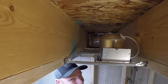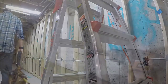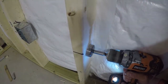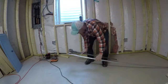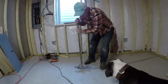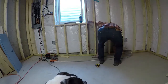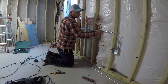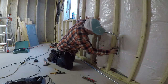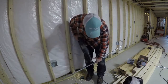Installing the can lighting is super easy — you can use the nail they provide on the extension arms or just a drywall screw like I did. Now the hard work begins. I used a 1.5-inch Forstner bit to drill all my two-by-fours, making sure to stay at least an inch and a half from the edge where drywall will be installed. Installing the conduit is not as easy as it looks — figuring out the angles and where to bend the pipe took some trial and error.